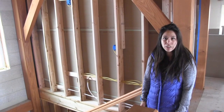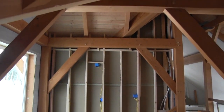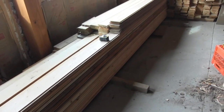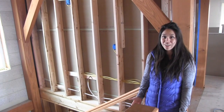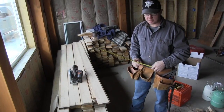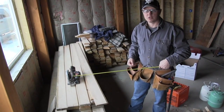We have some leftover tongue and groove from the ceiling. It's not in the best shape, so I was thinking about using that. It'll give it a lot of a rustic look. And I want to try out this wood aging agent on it that mimics the process of wood naturally graying on its own, and see how that looks. So let's get started. We got our T&G. I'm going to cut it a quarter short because we're going to run up some 1/4-inch trim on the outside.